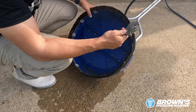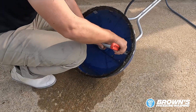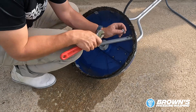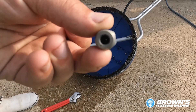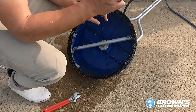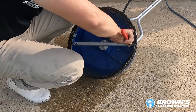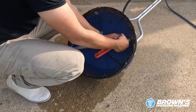I've got my crescent wrench here. All I'm going to do is narrow it down to fit onto the nozzle and just rotate these nozzles off — unthread them. I can look down in there and see that it's pretty clear, nothing blocking this nozzle. But I go ahead and try to clean all of them out if I have to take them off. It's always good to make sure there are no obstructions in any of the nozzles.